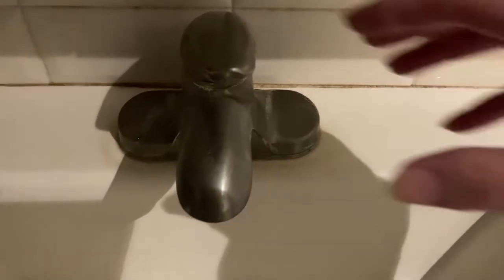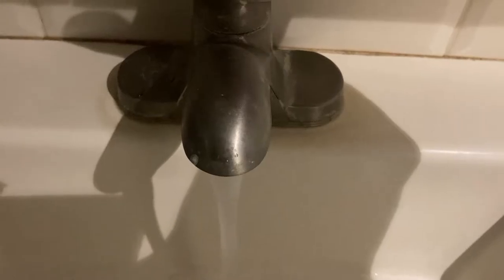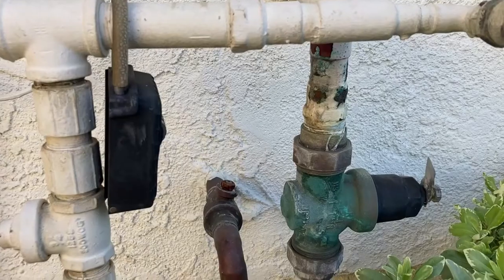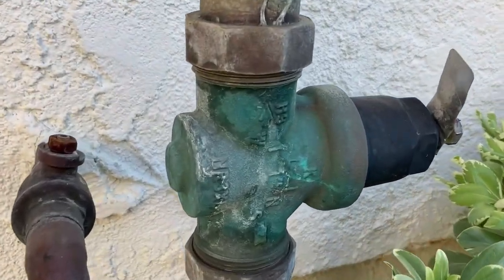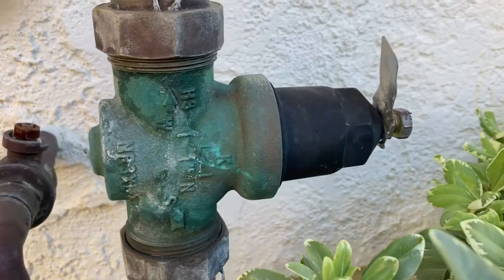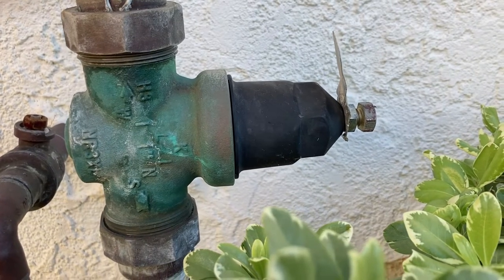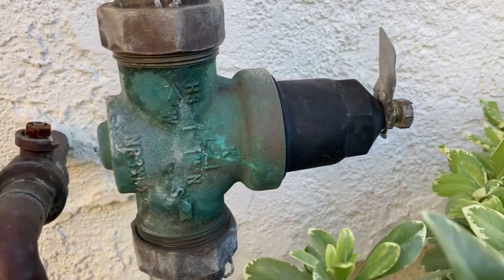If the faucet is closed for over 1 minute and opened again, the water pressure is higher than normal in the first 2 seconds and then decreases quickly to the normal stable pressure. It seems like the water pressure in the home builds up in just 1 minute after the faucet is closed each time. The most likely reason for the initial higher pressure is that the pressure reducing valve is not working well and there might be a leak within the pressure reducing valve.